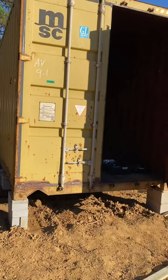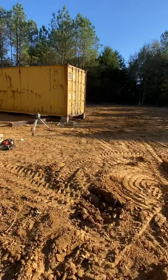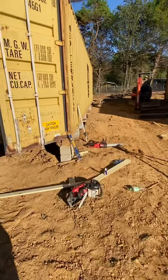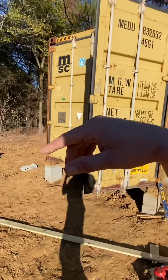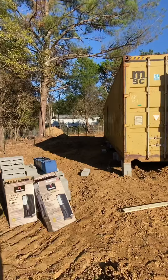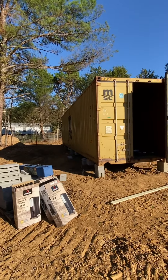This one's got a little bit of a jump. They may build up some around it, or either build a ramp and go up to it or something. That one over there ain't as bad, but they should be leveled with each other. What we did to level them with each other is I set the transit and then we took the transit stick, went along this bottom rail right here with it, and got them leveled. I did tilt them a little bit out this way — that way hopefully all the water will drain off this side. They've got about a half to one inch drop coming to the outside, but they're pretty square with each other and they all do fine.